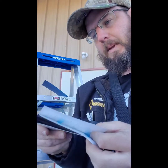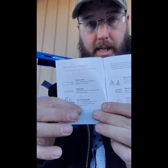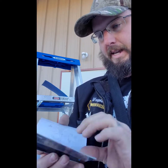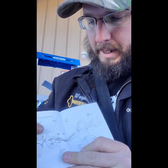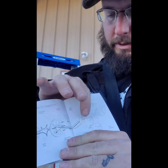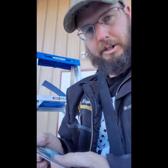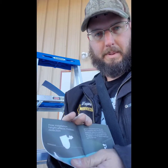From the instructions: before you begin, you'll find the little Phillips head screwdriver, the mounting bracket, your wiring nuts, screw caps, and a bag of screws — all inside the box. Here's how it all fits together: your wires come through, go through the bracket screw plate, there are your mounting screws, and they hook up here. The camera and floodlight screw directly onto that. They send connectors and everything with it, so you should have everything you need and shouldn't need any extra hardware store trips unless something is off.